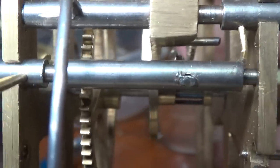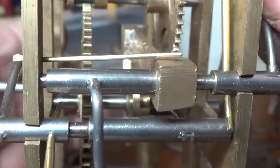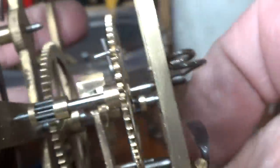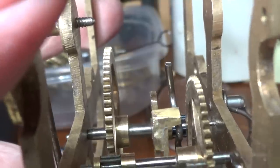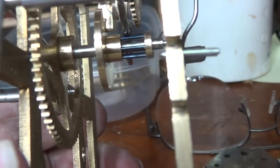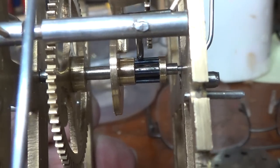I don't think this lever came from this clock. Likewise, this lever has that much end shake. In fact, they didn't put the wire in there. That was what was knocking that completely off of the cam because there was so much play. So what I'm going to have to do to take the end shake out of this so that we don't get levers going all kittywampus or cattywampus,